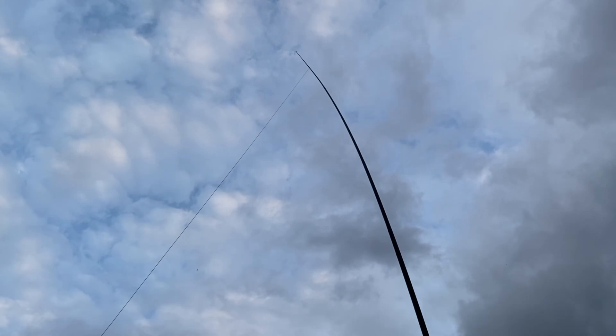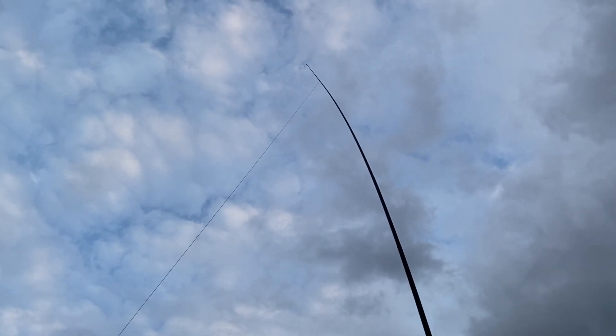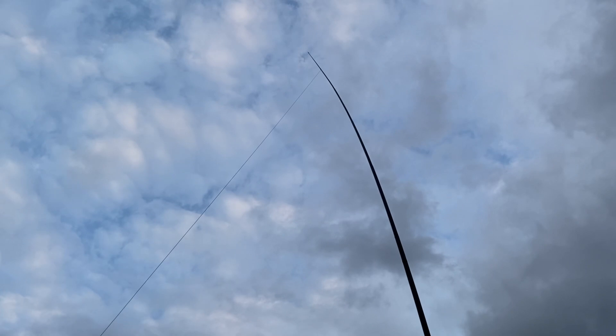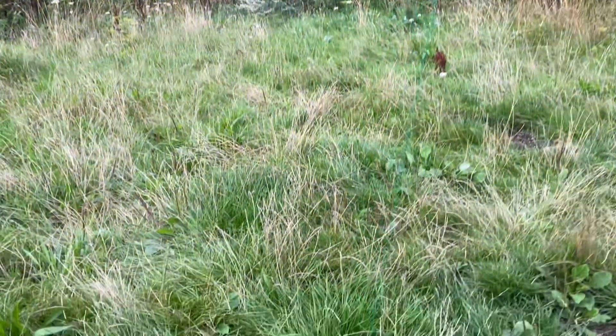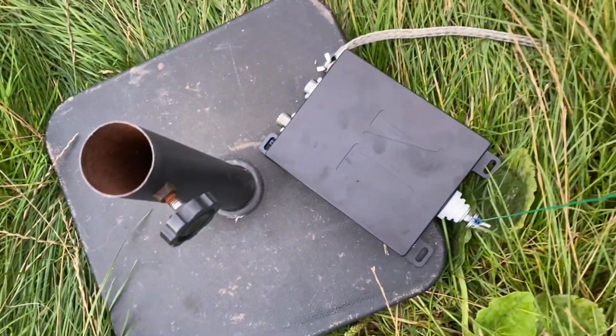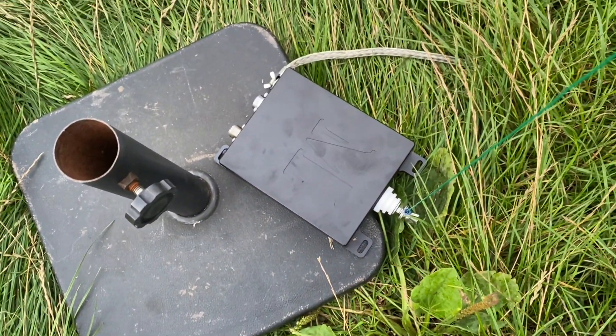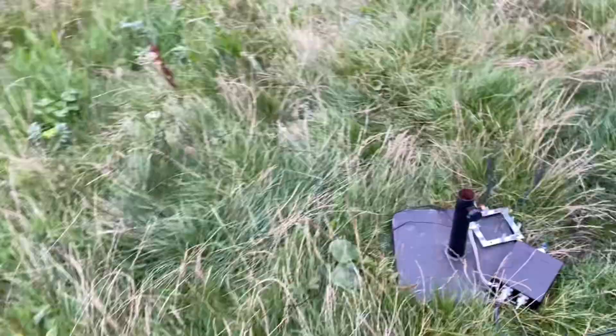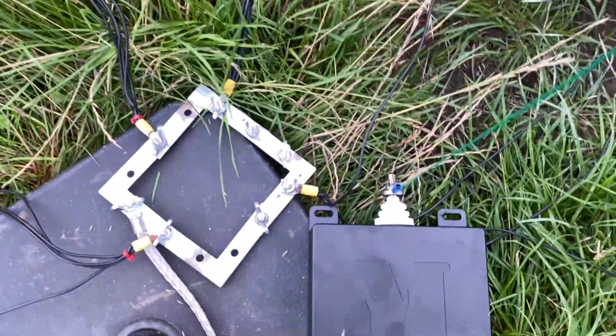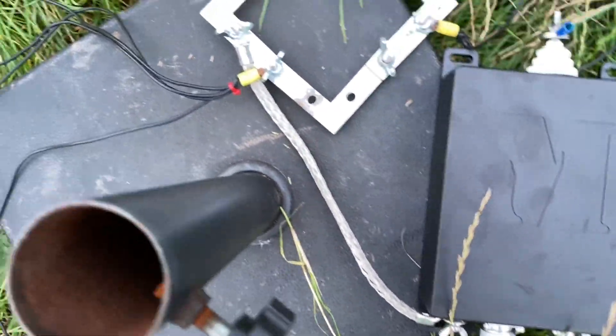There's the sloper — that's about 8.9 meters towards the top of the pole, not far from the penultimate section of the 10-meter pole. You just have to add the radial system. The light is fading, so here's the final setup. This is the wire coming into the tuner. There's an earth strap going into the makeshift radial plate, and there's about 40 meters of ground radials scattered around the place.